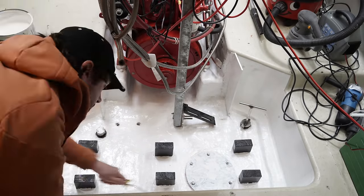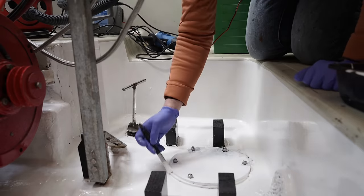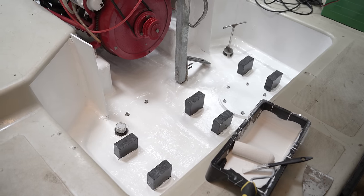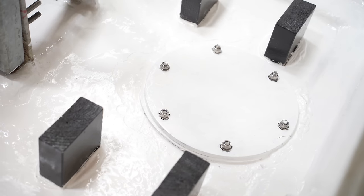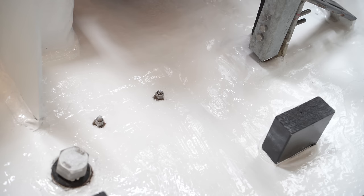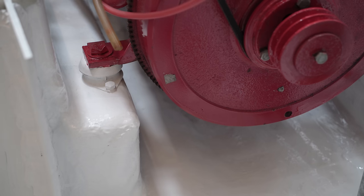I've also taken the opportunity to extend the spring cleaning to the larger drop section in front of the engine. Originally in the lifeboat layout this was an area for the small battery box containing a couple of 12-volt engine crank batteries. Below that enclosure was a diaphragm to ensure the lifeboat couldn't be released from the davits while aloft, and a pump to send sea water to the sprinkler system around Alan's exterior. I ripped all that out obviously, as we have no need for a shower on the deck. The resulting large hole I've closed up with a basic sandwich of steel plate, gasket rubber, nuts and bolts, and a liberal seal of 3M5200. I blocked the other aperture with sealant and locked it off with a female threaded cap. There is now a battery box for four much larger lead carbon batteries, secured on top of six black supports so bilge water can't reach the battery box, and also leaving space for installing high-density ballast later.